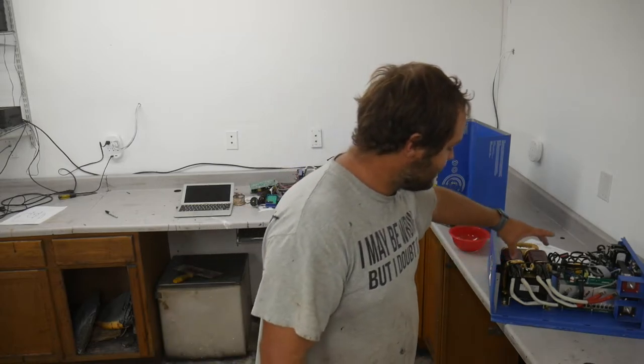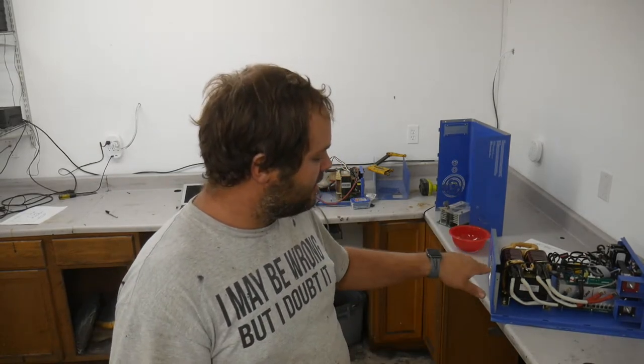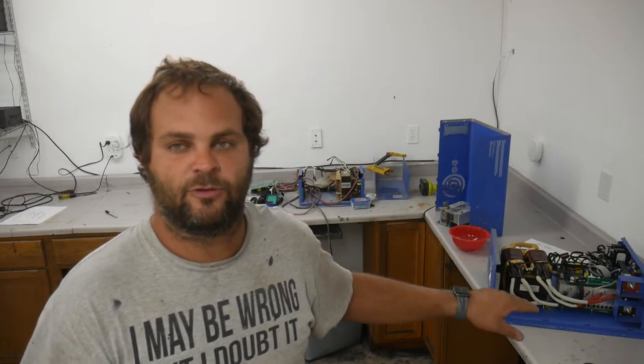That probably sounds kind of confusing, but I want you to understand: if you hook a DC load or DC power supply up to the primary winding of a transformer, you'll actually get an output spike. But quickly that spike will go to zero, because the core of the transformer becomes super saturated and there's no more change in magnetism in the core. If you hook DC into the primary side of a transformer, you'll get a spike, but the spike quickly goes away and goes to zero.